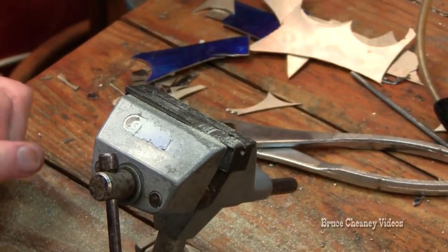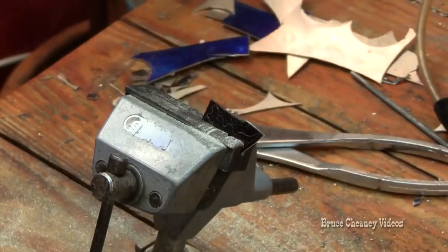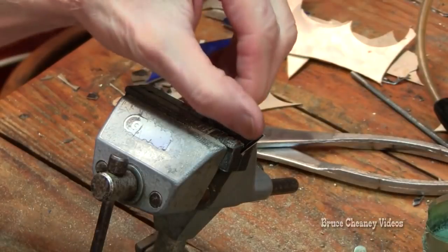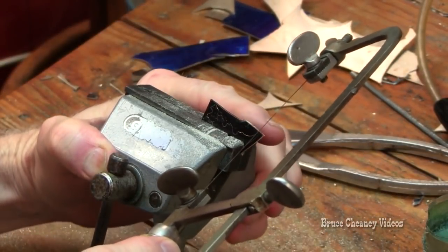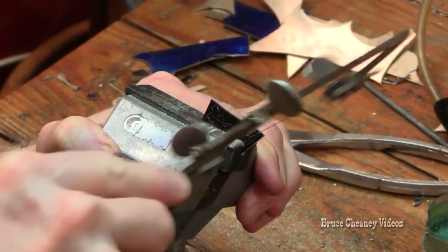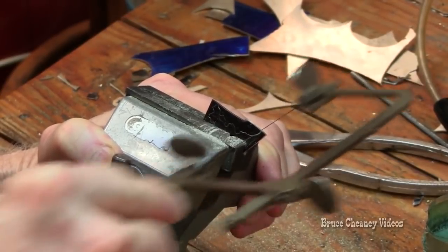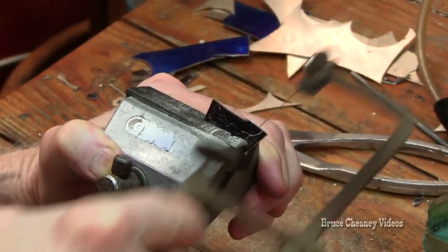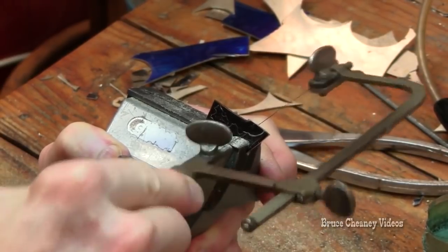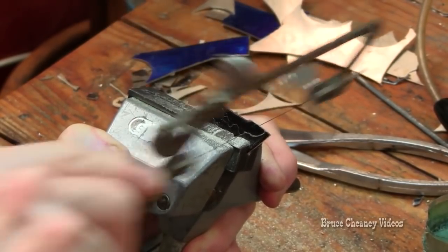I've got this little general vise. You can find these at knife making supplies and online. I've got a Scies 3 blade in my jeweler's frame here. The blade is in the saw backwards, actually. The cutting edge is facing forward. I find that this method is efficient for me, and I can cut a little easier horizontal like this than I can vertical up and down.